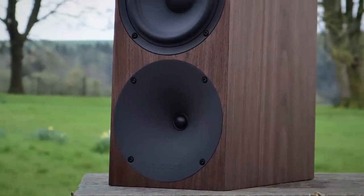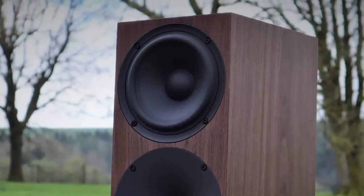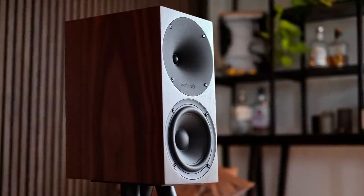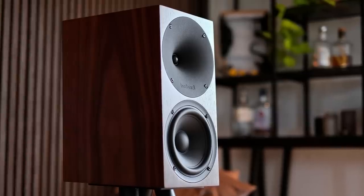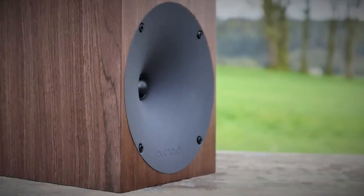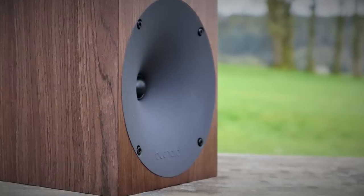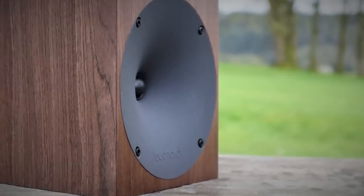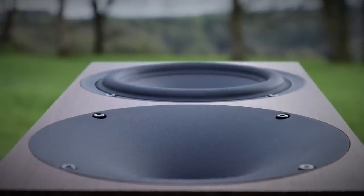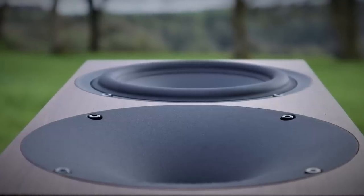The angled front baffle still has the inverted drive arrangement of the original, for better time alignment between the two drivers. That's unlike the active A500, where the drivers are the other way round because they're time aligned using DSP. The tweeter arrangement is unchanged from the Mk 1. It's a 0.74 inch 19mm soft fabric dome sitting in an aluminium CDC waveguide to control directivity and achieve the seamless integration with the mid-woofer that its predecessor was renowned for, crossing over at 1800 Hz.